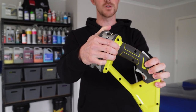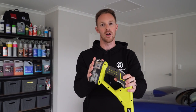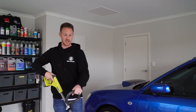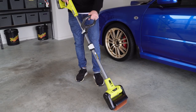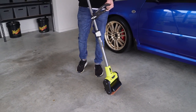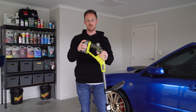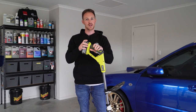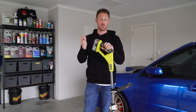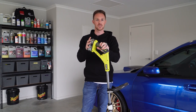Once we click the battery into the top of the tool, it's estimated to give about 50 minutes of run time at no load — meaning the tool free spinning. In actual use you'd be running it under load, so that battery life will be reduced. I'd want to use this with one of the more beefy batteries like the five amp hour. It would be tough to know the actual run time on a deck, but I'd probably cut that in half, so make sure you've got plenty of batteries charged up if you've got a big project.